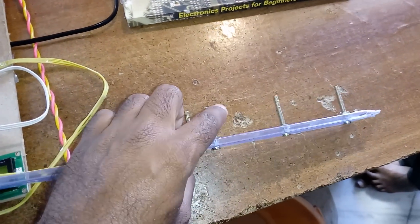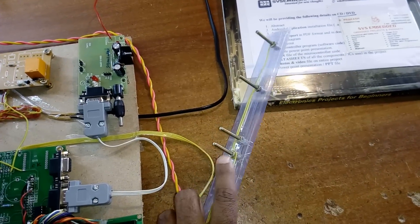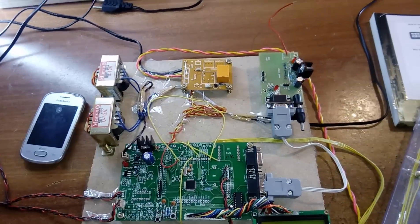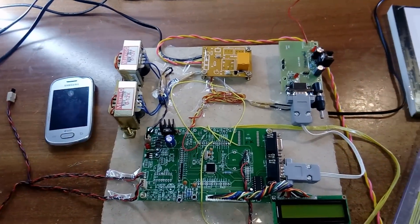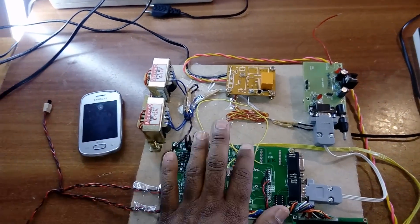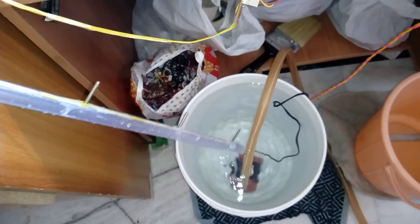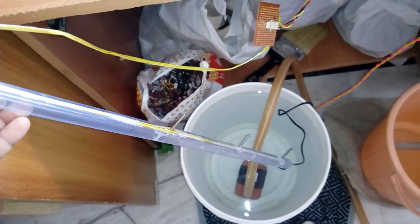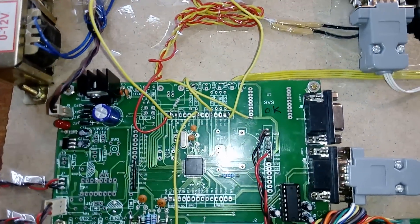In the irrigation crop field we have three soil moisture levels: level 1, level 2, and level 3. When water reaches level 3 it sends an SMS; if there is no water in the crop field it sends an SMS telling the owner 'there is no water, please turn on the motor.' For the groundwater we have three sensor positions: empty, medium, and full. The corresponding input pins are P0.16, P0.17, and P0.18.